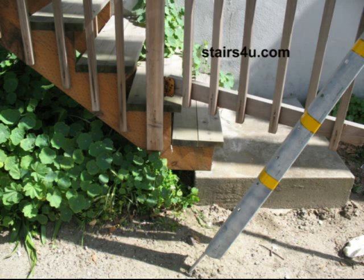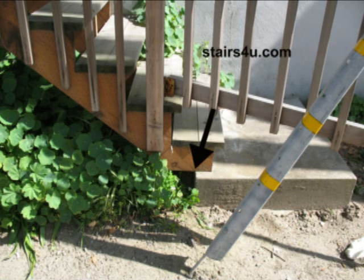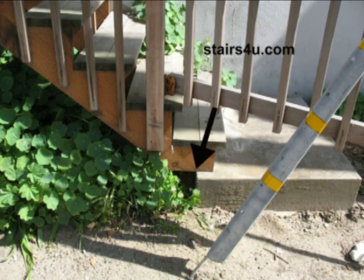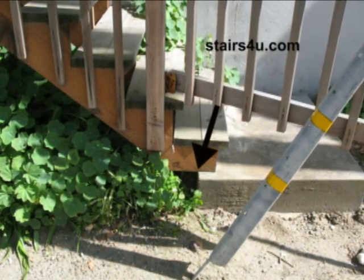Here's another one of those big no-no's, things that you are not going to want to do in stair building. I've seen plenty of stairs built like this that last for years, so when I say this is something you shouldn't do, that doesn't mean it won't last. Here's the problem: the bottom of the stair stringer is not resting entirely on the foundation or the concrete landing here.